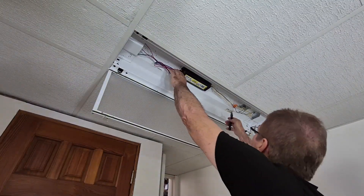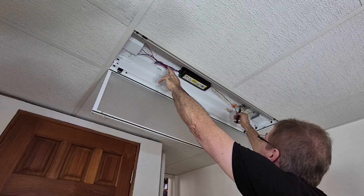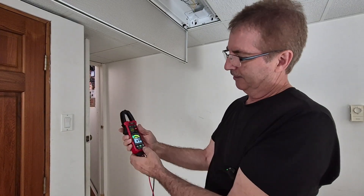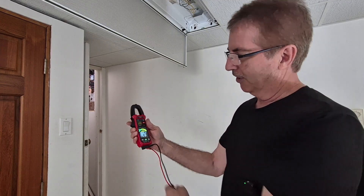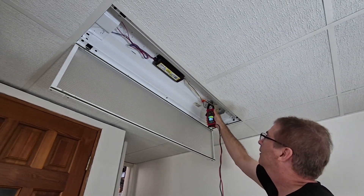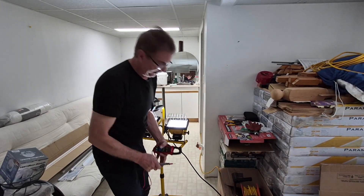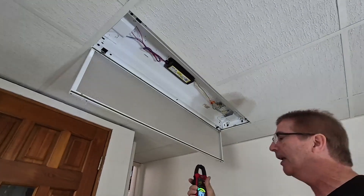The reason why I'm cutting this as long as I can is because I've got to bring this wire. I'm going to use the colored side over to the load side over here, the black one. So I'll cut this one as long as I can. To verify, you can also take a meter and select the non-contact mode to see if you have any power. I'm not showing any power at all. Verify I'm hooked up correctly — when you do have power it just lets you know by beeping. I've got nothing anywhere in this light. Just a double check — we're good, no power up there.